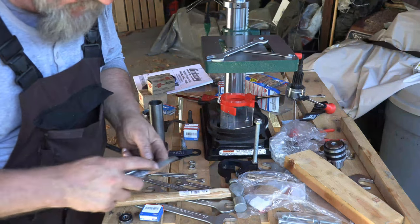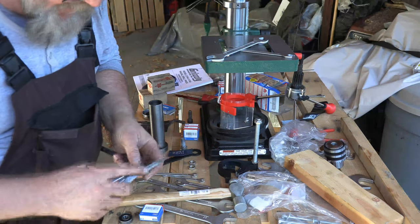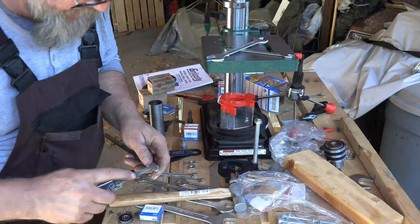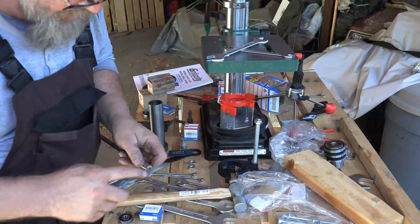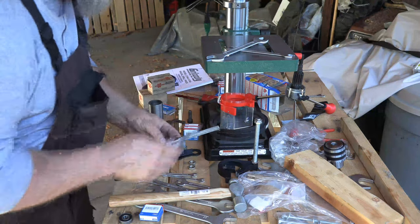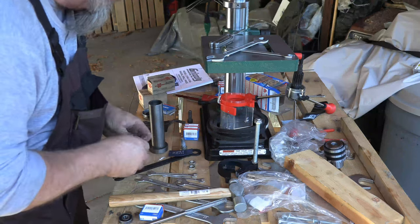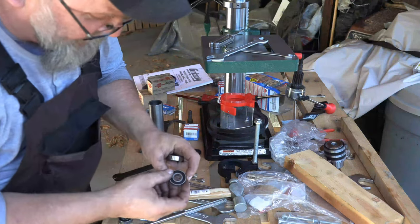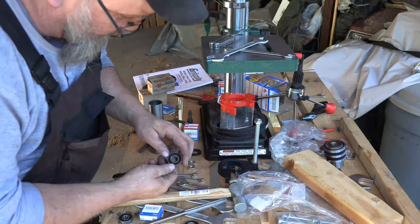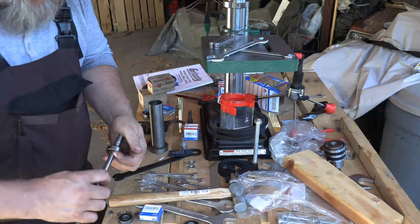This really doesn't affect anything, but it just looks bad. So I'm going to go ahead and take my file here and kind of clean it up. This could have been already boogered up before it even came out of the machine — it doesn't look like it was machined all that well. The places where this thing took the damage weren't all that critical. I've brought snap rings, so I've got some of those. This bottom one takes the larger one here, which is the 6202.